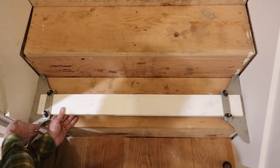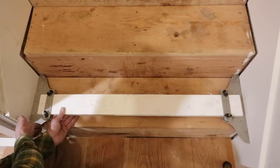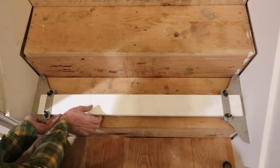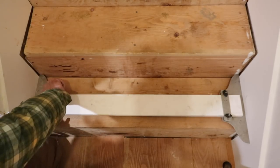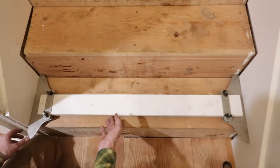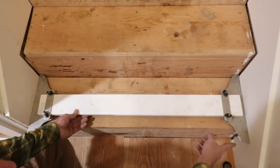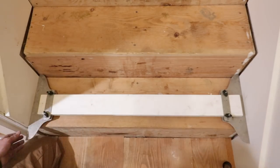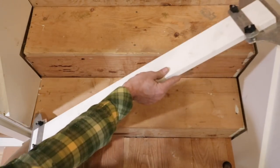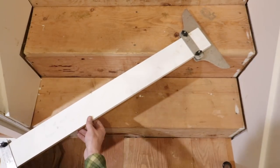Because we're doing it this way, we don't want to cut miters up and down following the stairs like they used to do. If we can cut these tight and put them up against these skirts, then we're all done. So what this essentially does — this is a one-by-four with two ends that you can change the angle on. We put them up against the back of the riser, push them tight, adjust each side so it fits perfectly. Now when we slide this out, we can use this as an exact template and transfer the lines onto our tread and get a perfect fit every time.